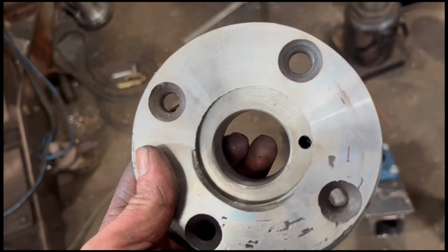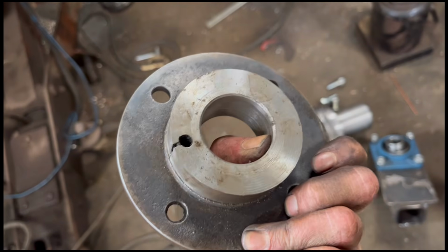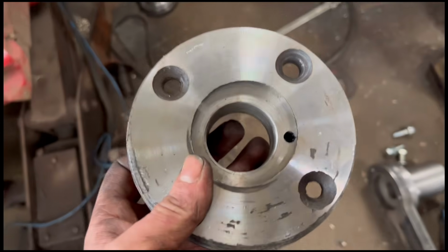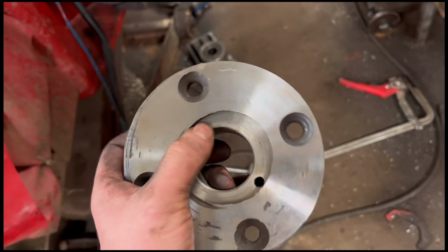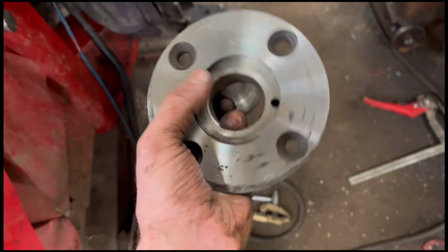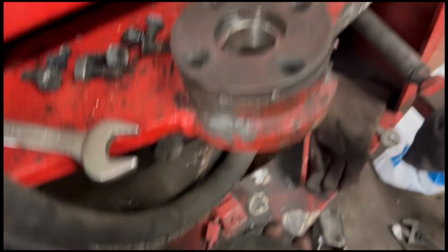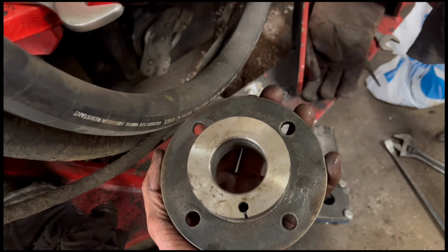So that's the bottom one barred out, and I've knocked that in there, so that should do to line the bottom up now. It's fairly worn, the hole in the middle, that's why it looks oval, because it is, but that shouldn't matter. So I'll put that one under there now, that one in the top, and then put the bar through.